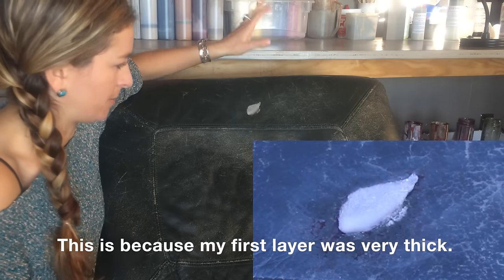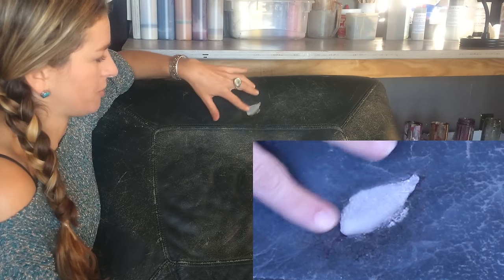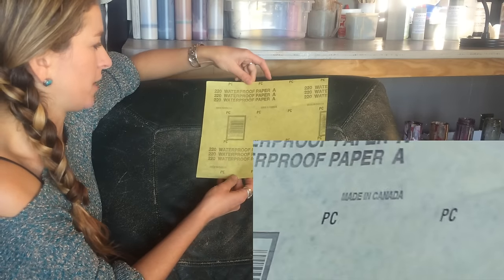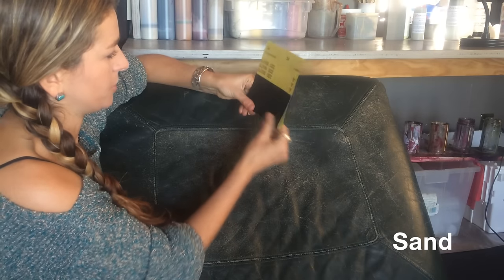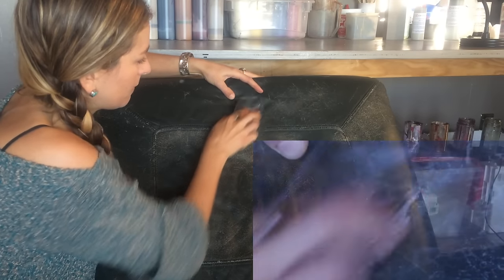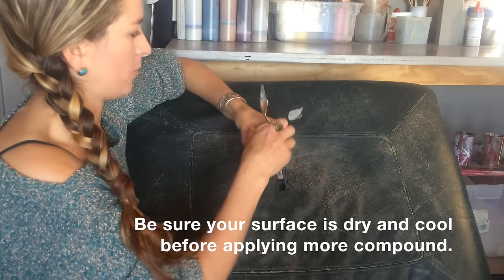If in doubt, just walk away and come back. I've got a little ridge here that I can feel — a little unevenness. To save myself trouble later, I'm going to start sanding. I've got some 220 wet or dry, and I like to cut the pieces in half and fold them into thirds to make them easier to work with. I've done a quick sanding to take off the little pimples and take down the ridge, wiped the dust off with a damp rag, and now I'm going to add more filler.